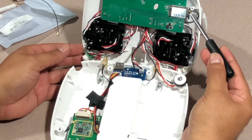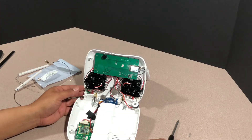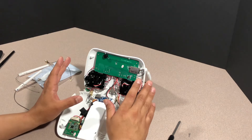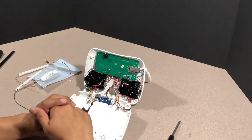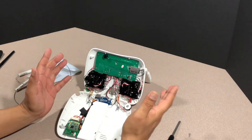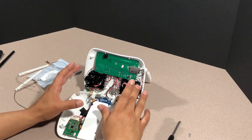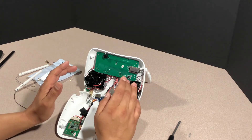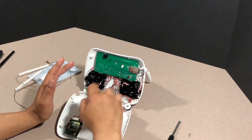Your TX pigtail goes to your TX chip and your WiFi pigtail goes to your WiFi chip. This is one of the most simple modifications you can do for distance and range, and for video quality — very inexpensive, very simple, you're not really ruining anything. Just be sure to take the power completely out of the controller, and before you power anything on make sure you have your antennas connected. Don't ever turn the controller on without the antennas — you'll fry the chips.